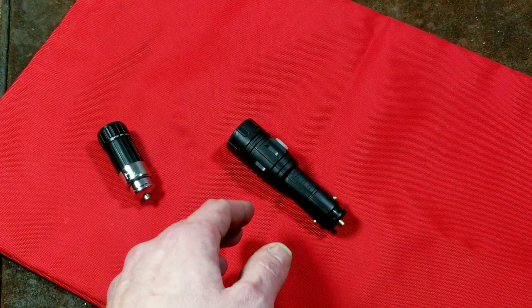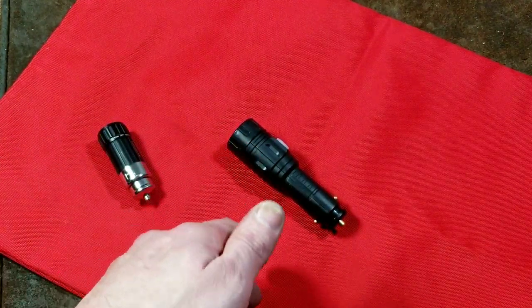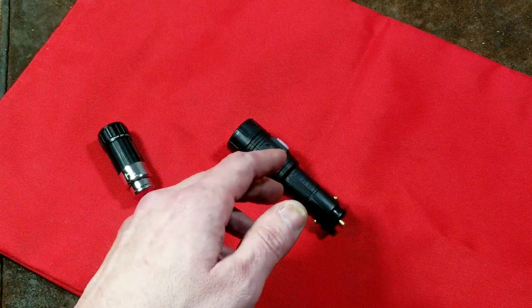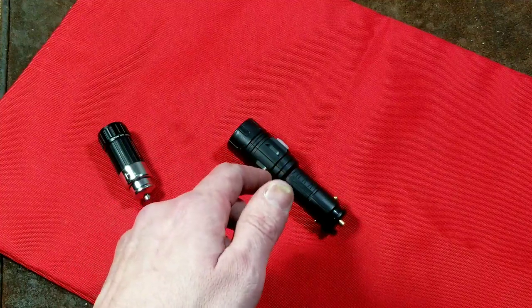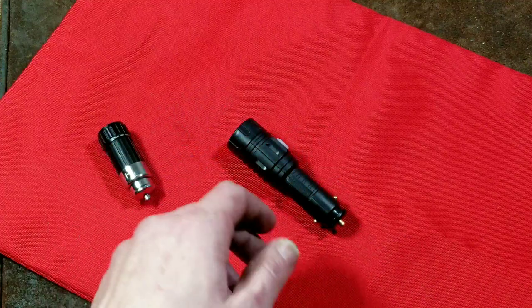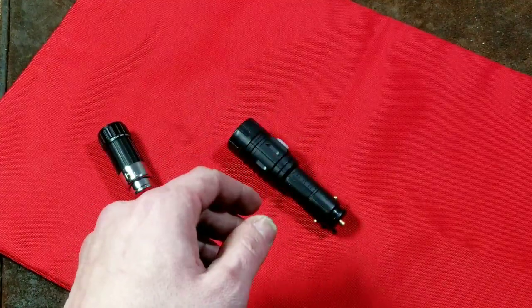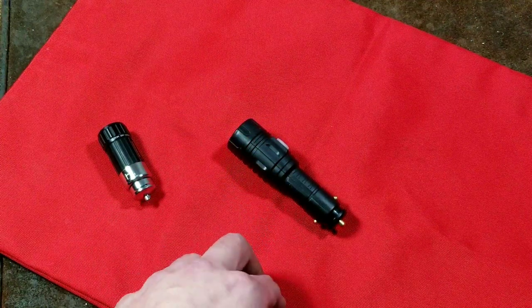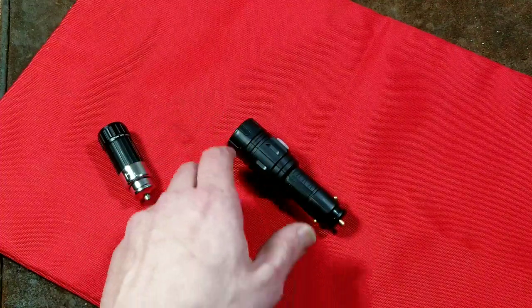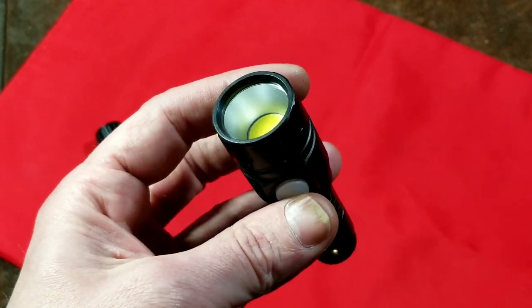It's just terrible to let any battery sit there and bake on the charger. It's always been a pet peeve of mine when people always want the battery ready to go — especially with lithium ions, which have very little self-discharge. Having them sitting in the charger for days actually costs you battery life. This applies to most battery chemistries besides lead acid, and even lead acid will have issues if the voltage is set too high.